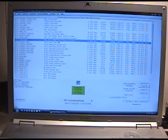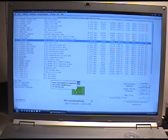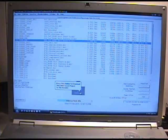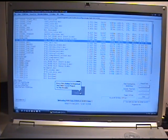We're going to write this sound project now to our decoder, because we've erased everything out. It currently wouldn't make any sounds if we put it on the track. It would still run. But now we want to add these new sound projects back into it. So let's get started. There's only really one step involved in writing the sound project to the decoder, and that's clicking on the big green button in the middle there. And it will go through another flash erase just to make sure everything is out. Then it will write in the program file, the SDF file, which it's doing right now, and then it will go through the writing of all of the WAV files that we're using within the sound project. And that just takes a minute or two.